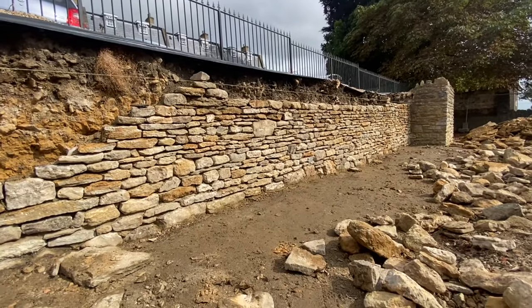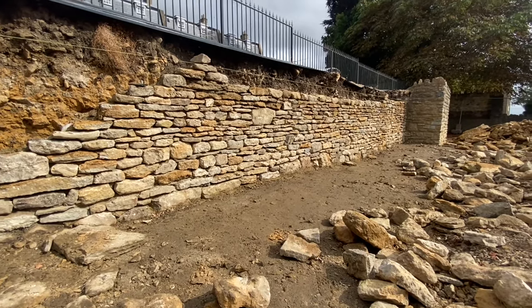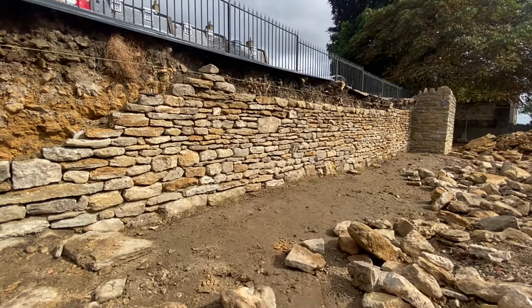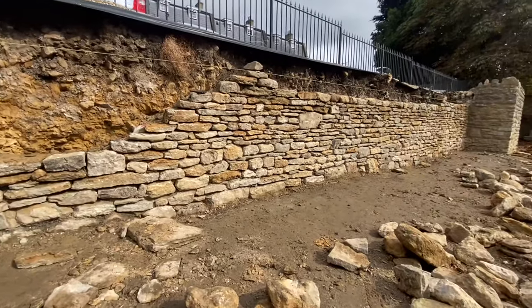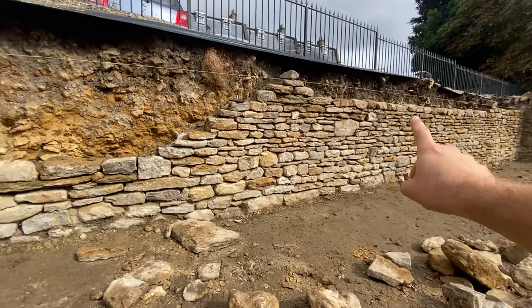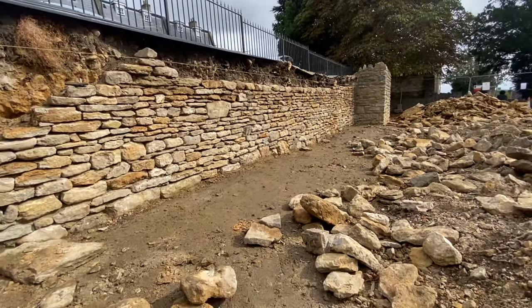So we'll see how we go, but we've been lucky all week basically with this sort of style, because once we can get a load of hearting in, and obviously the stone on top of the mortar, it protects it from the elements. Yeah, no, so Cam's done well, got this bit up, so we'll continue that line tomorrow and then work in this baby. And I think for the stone we've got on that, we're doing pretty good.